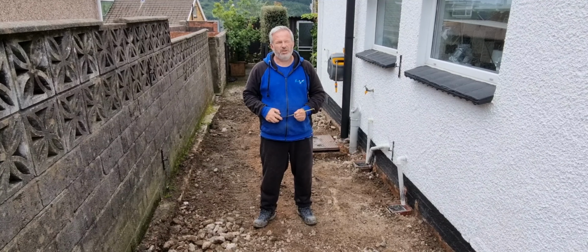underneath here, that was mud. So we've had to again take that off. We've got our 100 mil scalpings, MOT type 1. This, we've spoken to the client, is an old armoured cable, so that's redundant, but we never say never, so we always treat it as if it's live. So we're ready now for the MOT type 1, which we'll show you next.